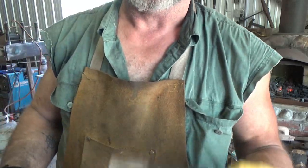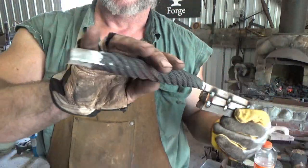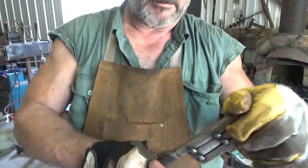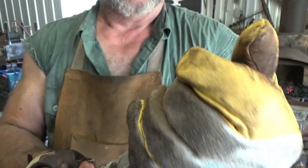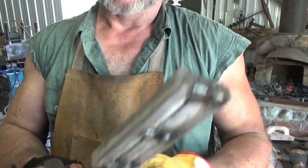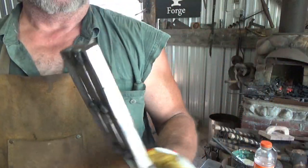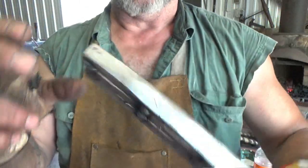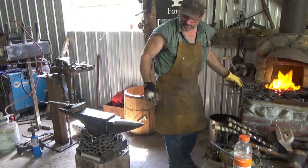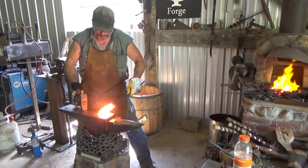Alright, here's my plan. I cut the tail off and ended up with three pieces that I welded together. This piece is still forge welded so I can do something out there if I need to. Get everything closed up tight, flux it up and see if we can get a weld on it. It's an awful lot to do with a hammer — at least I don't know how to do it well, especially when it's that narrow. Alright, I changed my mind — I went to the four-pounder. I'm going to try to do some heavy hits to get that thing down through there.